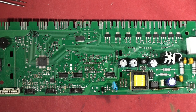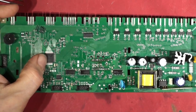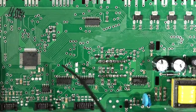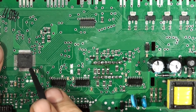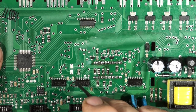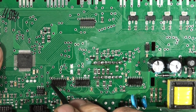This is a multiplex display and it will be driven from the micro over here. You've got your microprocessor, then you've got your three shift registers. The micro will have a clock pin which clocks the data in to the shift registers, and the data that's clocked in percolates through the outputs of the shift registers.